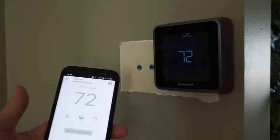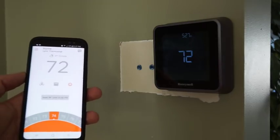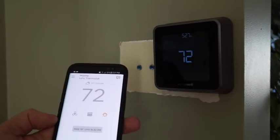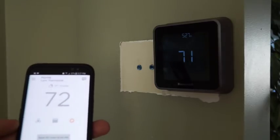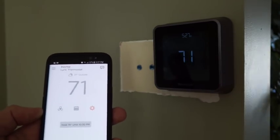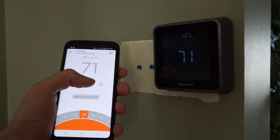There are a few things I don't like about this thermostat. I wish there was more ability to tweak the settings — more temperature set points would be great, and it would be really good if you could adjust the sensitivity. What I mean is the thermostat allows some degree of tolerance, so maybe it lets the temperature drop to 71.5, heats up to 72.5, then drops back to 71.5 before turning on again. With the Ecobee and maybe the Nest you can actually adjust that sensitivity, which lets you cycle your furnace less often — better for the furnace. It would also be nice if there was a memory for the schedule, allowing you to switch between geofencing and schedules without losing all your settings.